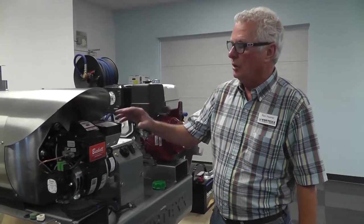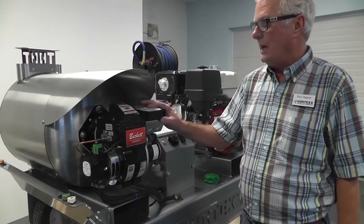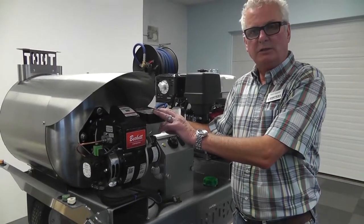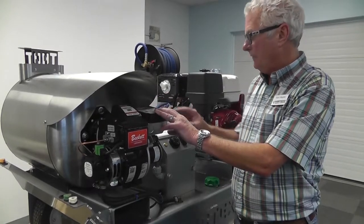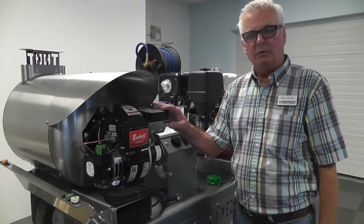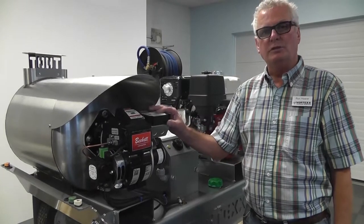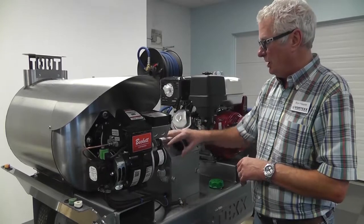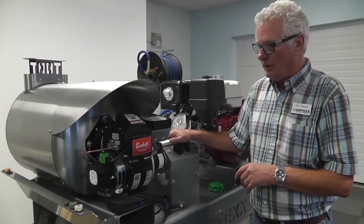With a Beckett Genesis system burner, there are a couple different timers in it. There's a timer that will delay it — if you do not get fuel after so many seconds, it's going to shut down and not try to restart, so you'll have to shut the switch and restart it. There's also a six-minute delay set right now, and that can be changed: if the gun lays on the ground for over six minutes and nobody opens that gun up, this will automatically shut down the system so you're not having the blower just keep running.